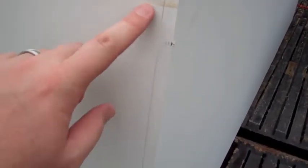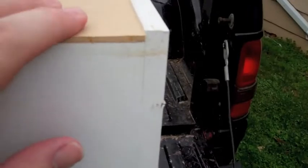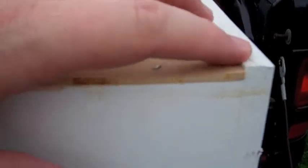It ended up being 7 foot tall, 40 inches wide, and actually it's a little more than 40 inches wide. It's about 41 inches wide because the boards themselves, the inside shelves, are 40. So the outside is going to be a little bit wider. What I had done here was, you can see I missed with a staple. But this is just a 1/8 inch hardboard MDF, and I laid it down. The inside was the factory edge. I laid it down inside the board here.